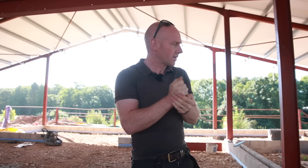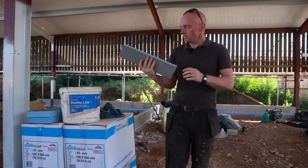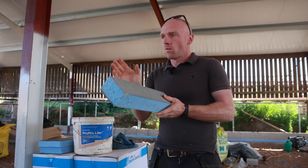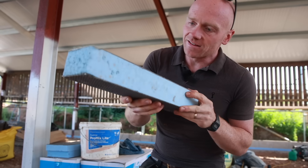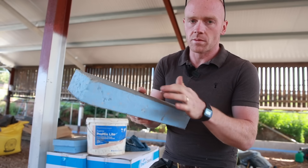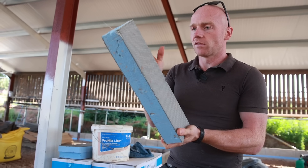So what we went ahead and purchased was a product called Thermoblock. Let's grab one and I'll explain what it is — Eden's doing camera duty today. So this is what we've been using; we bought them quite early on in the build. I thought originally we might need to use them on both leaves but that isn't the case, and I'll show you why in a minute. It is like an XPS insulation with a cement fibre top and bottom. It'll remind you of a tile backer board, simply because it almost is one — Marmox, who make these, also make all those tile backer boards.